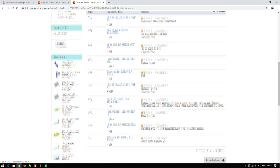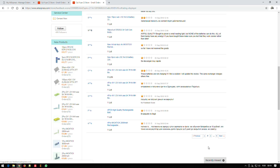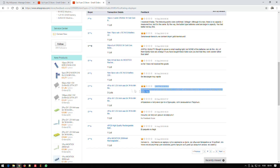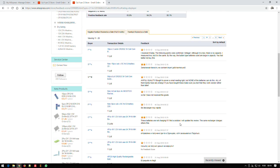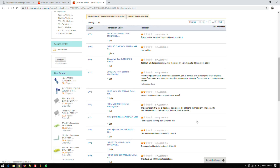That would have been perfectly adequate for many applications like small flashlights. This was clearly manufactured with the minimum capacity to make sure a lithium charger wouldn't refuse charging it, and the customer could put this on a device, have it power up, and give the seller a positive review — suggesting this was created with scamming people in mind. Given that they sell these as 2.6 amp hours, I have absolutely no problem calling this a scam.